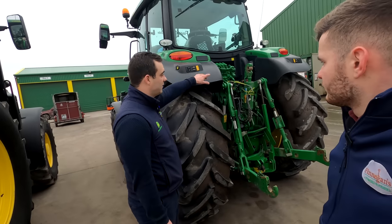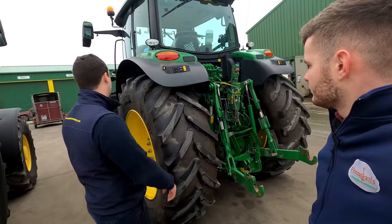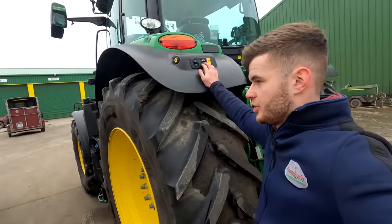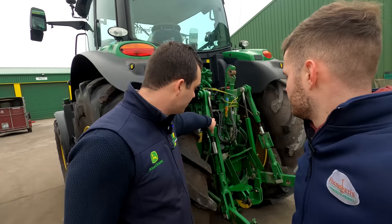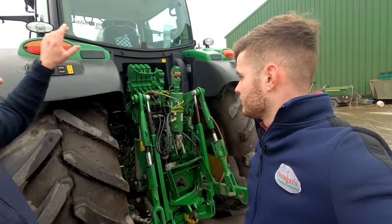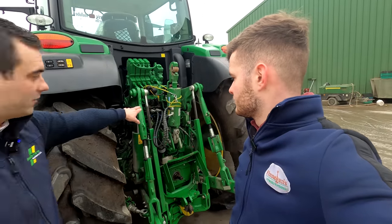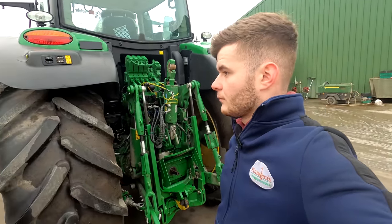You have your hydraulic controls here — standard for a hydraulic top link, handy for putting on implements. PTO, lift — if you want that to work, you have to put it in spool number three. It's all colour coded. If you look over at the spools, they're all colour coded on the back and correspond inside. You have your brown spool on the back and then you can operate it once the tractor is running.